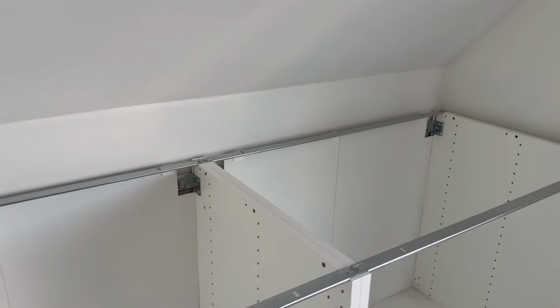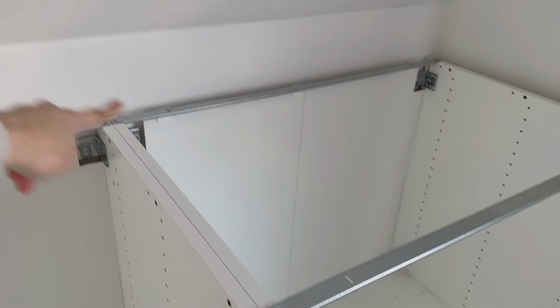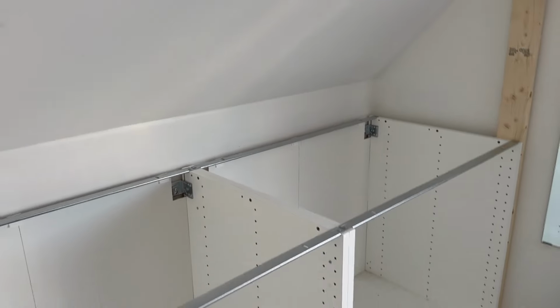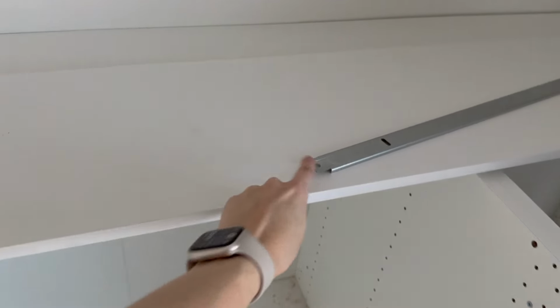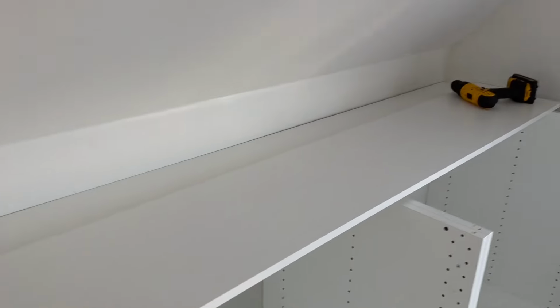We could not find any shelving that was 24, so that's why we're gonna do 2 12-inch boards. We just thought it was a bit nicer for it to be pre-finished the same as the material of the closet. We decided to take off these front supporting brackets, and we're just gonna screw the shelf into it because we think that provides enough support, and we'll screw them in.